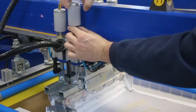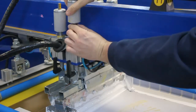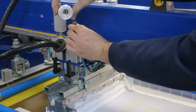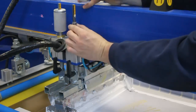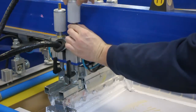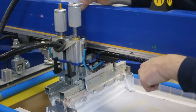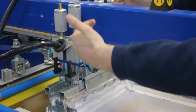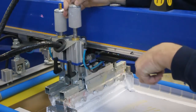One of the unique parts of this design is a spring and ball with a clicking system. If you look at it, that extrusion has a hex in it, and the balls operate with a spring — that's what keeps it contained during the operation of the machine so that the knob isn't moving on its own while the chopper is going up and down. It's a very unique design, an extremely heavy-duty knob system.